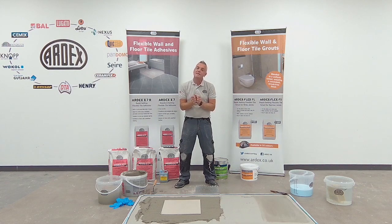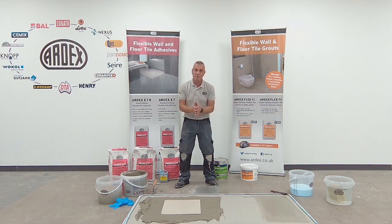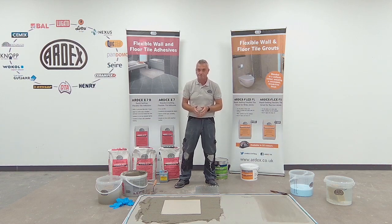And then what you've also got to consider is, when the tiling is completed, where can we try to cover it off? So you may need to consider trying to shield it where you possibly can. Direct sunlight on things like adhesive and grout compounds is obviously a key one, because you will see if there are any issues the following day when you come back to site, where you get shrinking and so on. So try to shield it off, put it in shade as much as you possibly can. Close doors if you're in the kitchen or a conservatory. Anything you can do to keep the sun away from the area you've been tiling until it's fully hardened, before you start the grouting process.